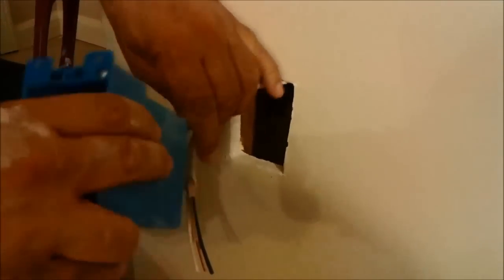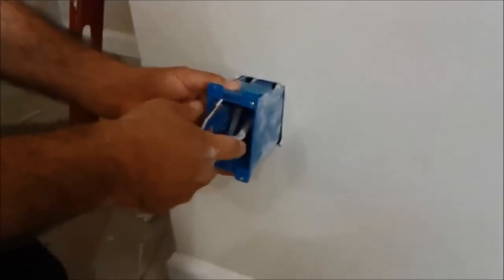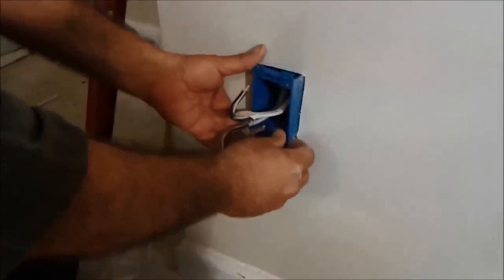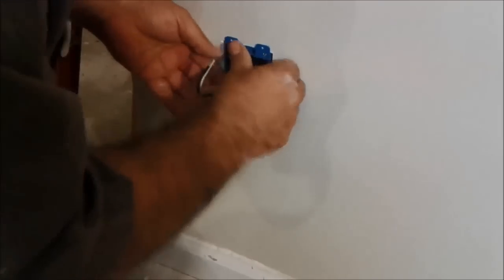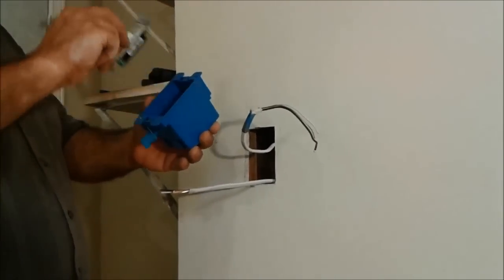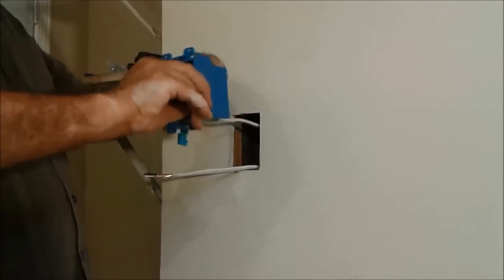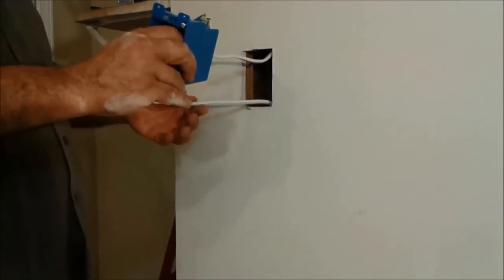You see this entrance to the box — I am going to open it. Now we have two wires going to the box. These are two cables and now we have to put the box inside the hole that we cut. So it is inside. Now we are going to secure it. I already punched the entrance. This cable is going in — the blue one is going up to the ceiling and this one is coming from the source, so that is going to connect to the switch.